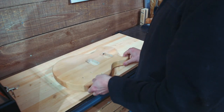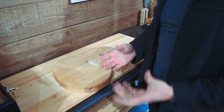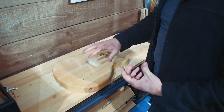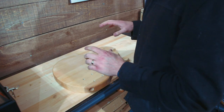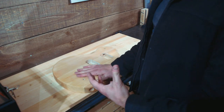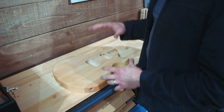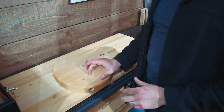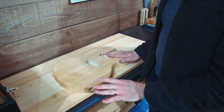You can use power sanders to do your final sanding, but hand sanding is generally better. Orbital sanders work fine, but you really want to try to sand with the grain, so they're not the best option. Vibrating sanders work well too and can give a nice smooth finish, though following the grain is still the ideal. You can do the bulk of the work with those and then finish off with hand or block sanding. Not every sander works here though — those little oscillating sanders from multi-tools tend to leave grooves and I do not recommend using those on a flat surface for finish sanding.